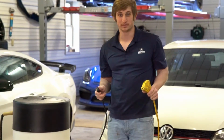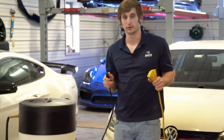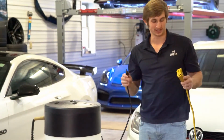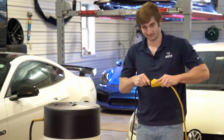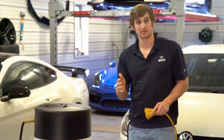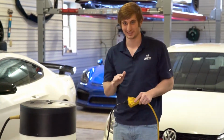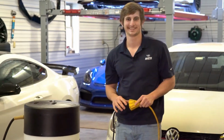After you turn your water on, you can expect your system to take up to 48 hours to completely fill. And once it's full, you can plug it in. When you plug it in, you can expect to hear the pump turn on until your hose expands. Once the hose is done expanding, the pump will turn off.